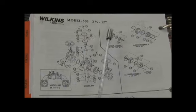So the 350 2.5 through 12 inch design, again, ductile iron body, inlet outlet shutoff valves, single access cover from the top. Groove coupling holds the 2 checks. The check components are modular. The check components go inside from the cover, held in by a small retainer clip. On the first check side, it's a plastic clip, and on the second check side, it'll be a stainless steel clip. Checks come out. The spring tension does not have to be released for the average repair.